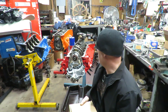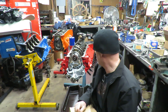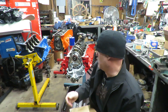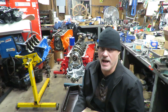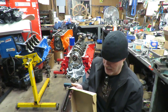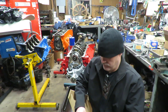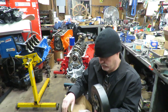For this engine, this is basically a stock 350 Chevy. It's going to have Vortec heads — it's mildly modified. It's got screw-in studs, some aftermarket updated stuff, but nothing real crazy. We bought a balancer and this balancer we actually got at AutoZone. They have a pretty decent balancer that they sell for a 350 Chevy — just a stock type balancer, but they're pretty good.